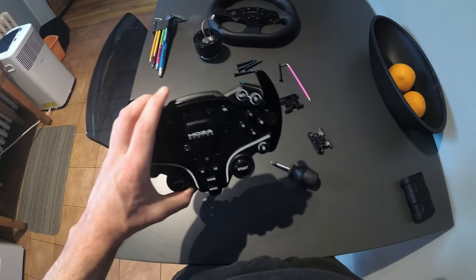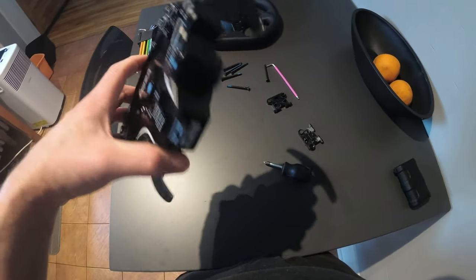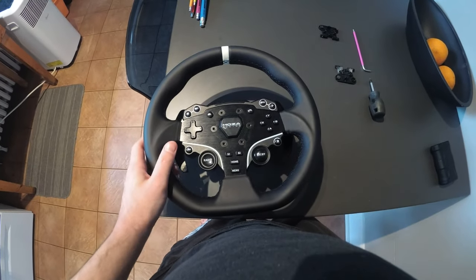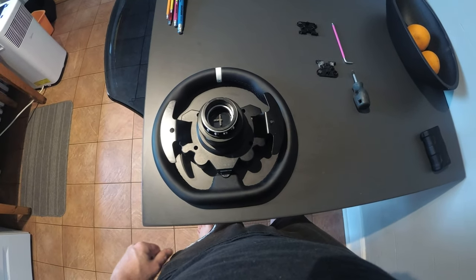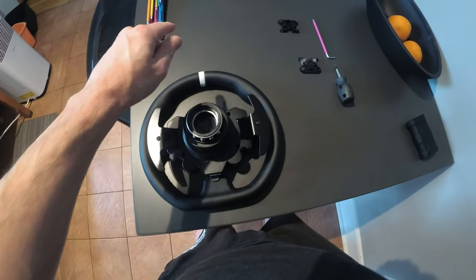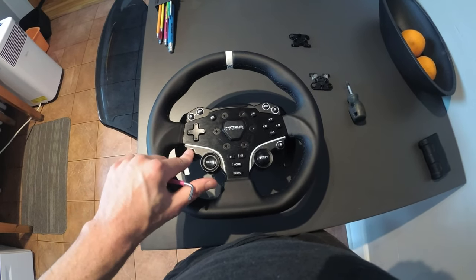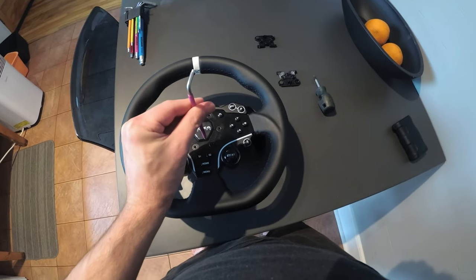So we tested it out and we got a little problem — there's not enough clicking in there, so we probably have to go in and tighten those up a little bit more. 3D printing is not an exact science, so they might need to be shaved down a little bit. I noticed mine were a little bit rounder on the back end, so we might need to adjust that. We'll go back in and see what we can do. So we put the back on again — all I had to do was some minor shaving down. The backs weren't flat enough so it wasn't clicking properly.